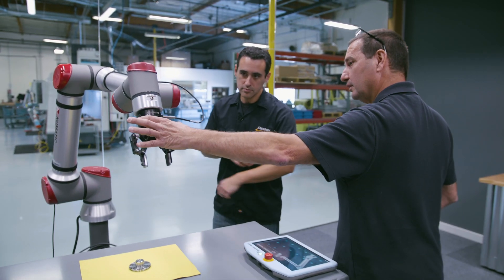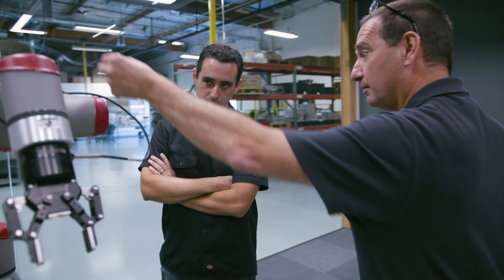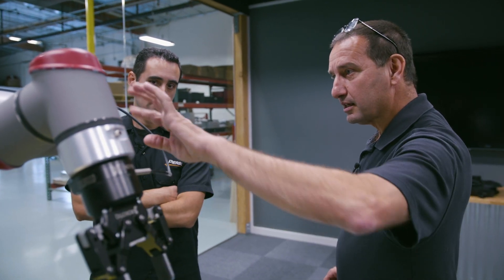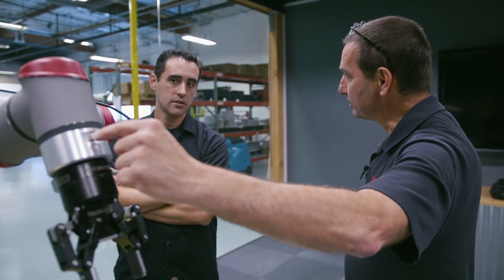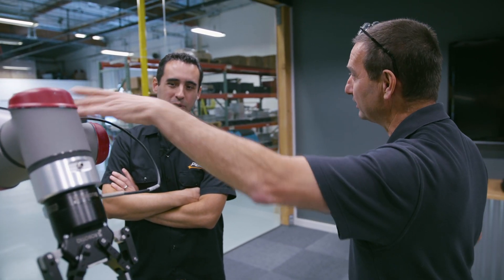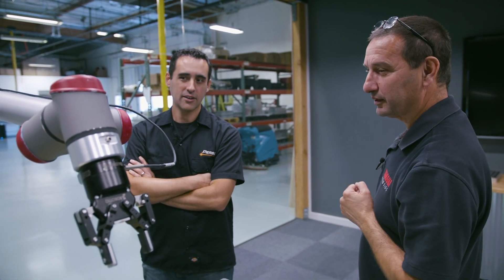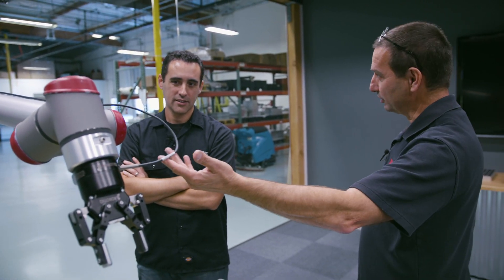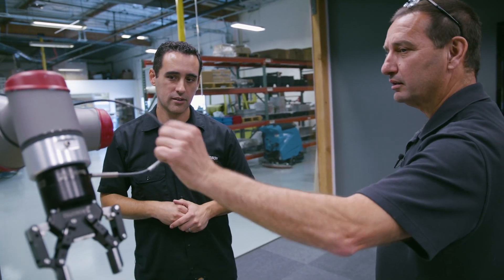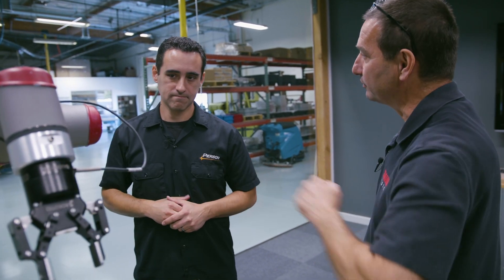If the camera was not here, the gripper used to have a base similar to this that used to go back to the controller and plug in. The new ones — because on the E-Series you have serial communication — there's just a cable that goes right down, so you have no more cable going back if it was only the gripper. Here we have the camera, so it's still the old-fashioned way because there's a lot more communication going on. So if I bought this camera, we would still need the cable. They're probably working on a pigtail so it connects right there, as now there's more capability in that connection.